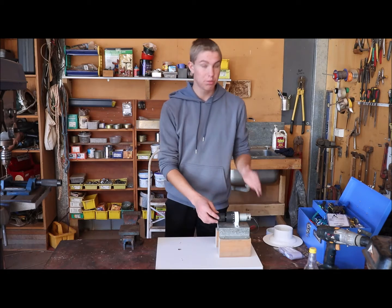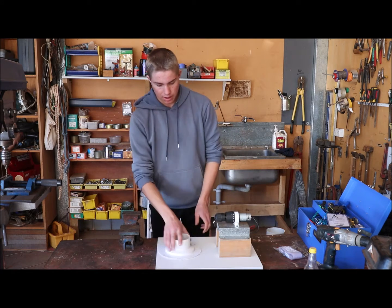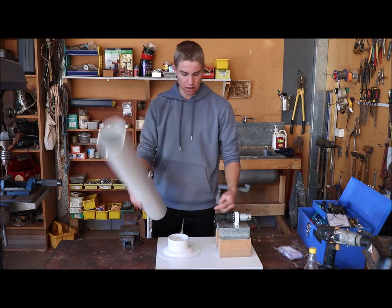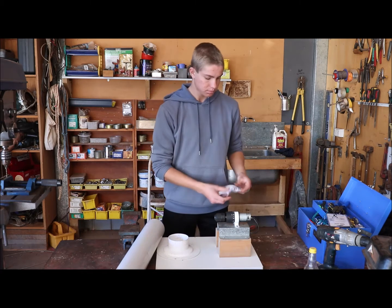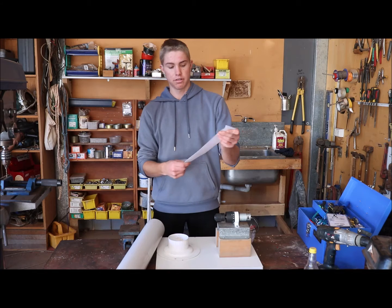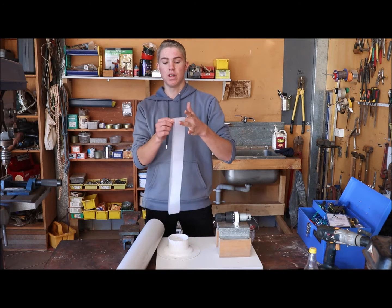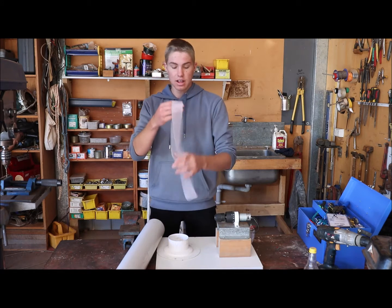Now we've done the motor, it's time to move on to the second part, which is the belt. We're going to start by getting this PVC pipe ending and mounting that to the bottom. I've got 750mm of 100mm PVC pipe to stick on top of that. We'll have a rod going from the drill into the bottom of the pipe, one at the top of the pipe, and the belt will run between them. I've got a proper Van de Graaff Generator belt from eBay — basically just a bit of silicone stretched into a loop. As the drill spins, it'll spin the belt and create friction at the top, which is what forces all the electrons up the belt into the big ball and causes it to spark electricity.